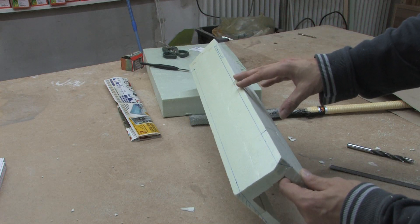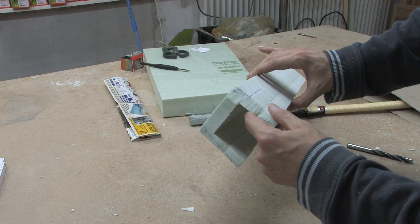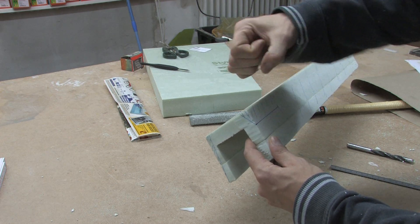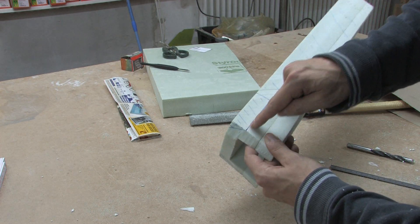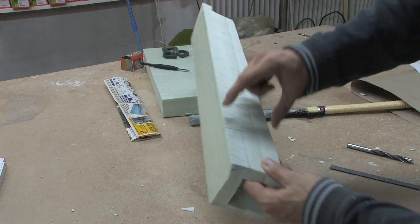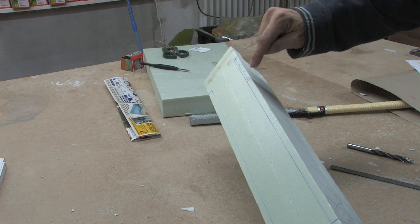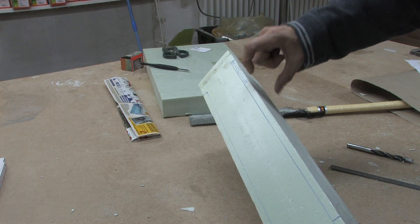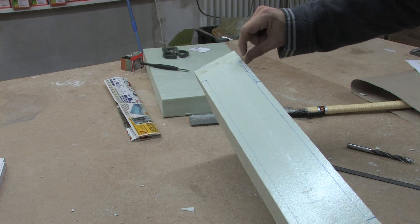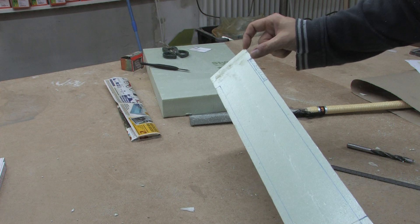The rear part of this piece is a little bit different — also a 1 cm deep cut. But the first part, as you can see here, is a very steep angle up to here, and then it again goes down to this edge here, up to this point here. And from this point, the angle is a little bit steeper and only cuts this part here, and again up to a point 4.5 cm from the top.